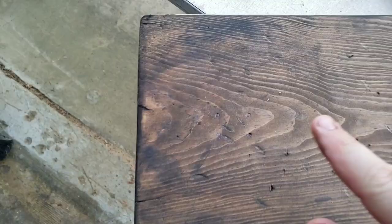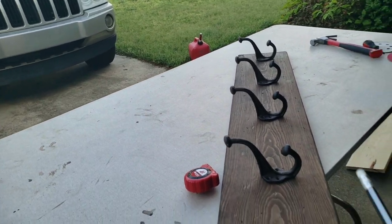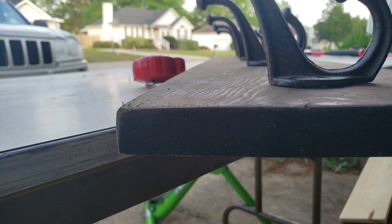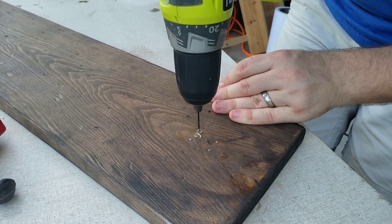Since I'm planning on selling this, I'm going to make sure it's nice, straight, and even, and the hooks are installed correctly. Now I've got the hooks set in place where I think they should go. I'm going to take another look at it, make sure it's what I want, and then go in with the pencil again and mark the holes for the other hooks. I've got the holes marked for all the hooks. I'm going to get my drill and pre-drill the holes a little bit just to make the screws go in a little bit easier. Another tip to verify the hooks are all level: look down them just like we were at Lowe's looking down the edge of the wood to verify it was straight — look down the hooks this way and make sure they look even. Now that we've got our holes drilled, our next step is just putting the hooks back over the holes and using the original screws that I told you to keep in the Ziploc bag to secure the hooks to the new wood.